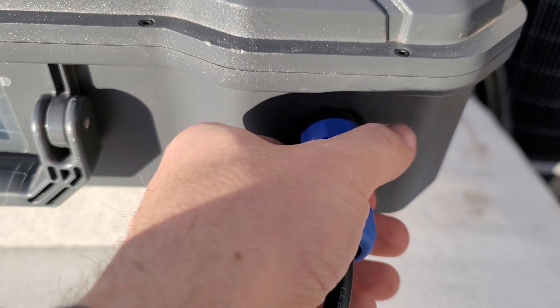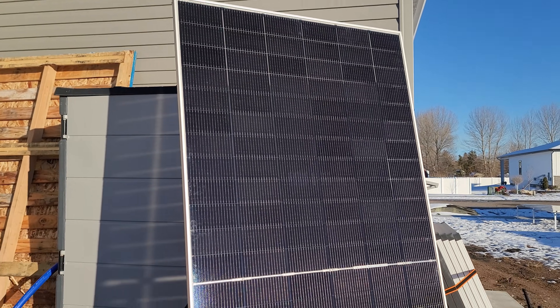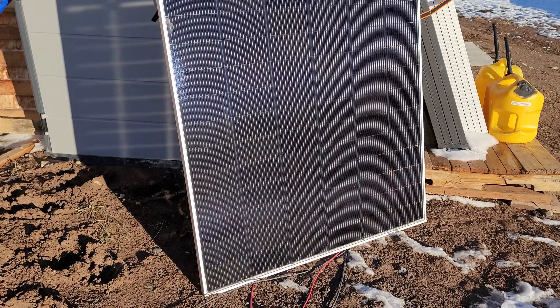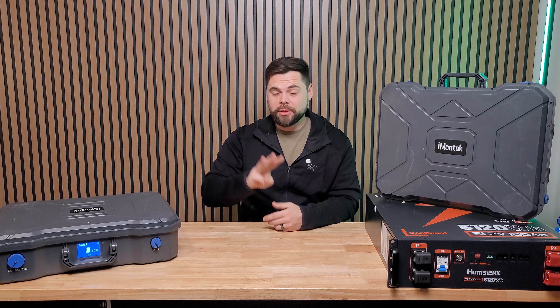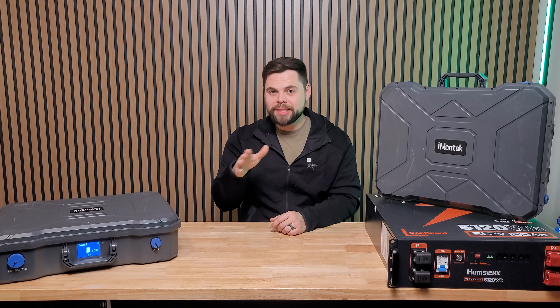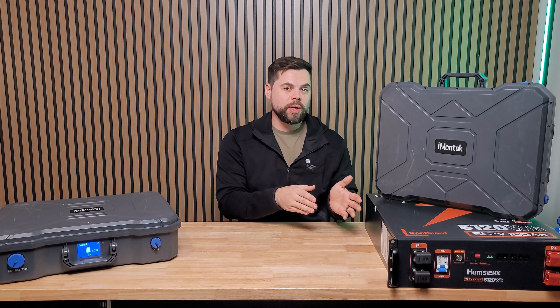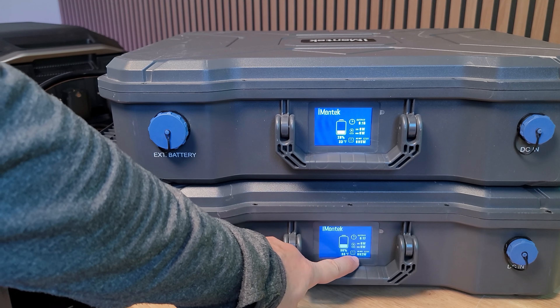The X1200 is technically rated from 12 to 150 volts and 20 amps — that's plenty of range to use 100-watt panels, 200-watt panels, 400-watt panels, 590-watt panels, whatever you want. The easiest way to get 1,200 watts of solar input is to take three or four 400-watt panels. Just check that the VOC or open circuit voltage is around 37 volts, because four of them in series will be about 148 volts. A car charger is included and you can get anywhere from about 80 to 120 watts of adjustable input. AC input and DC input all at the same time — not a problem for the X1200.